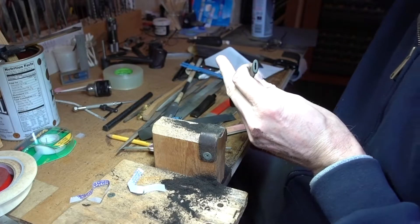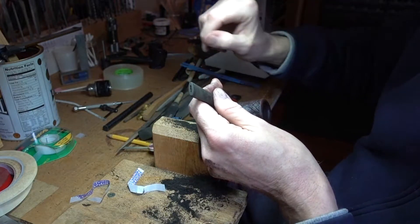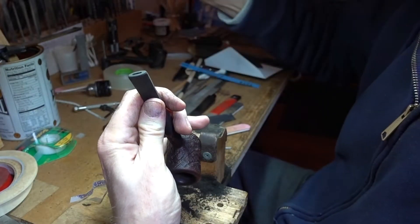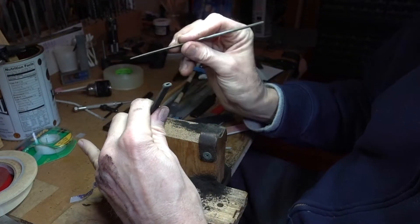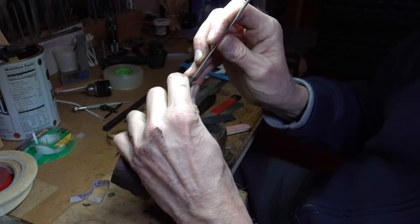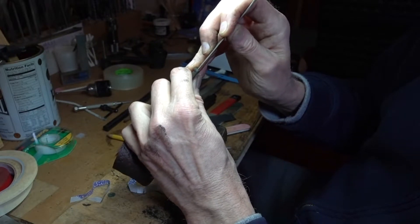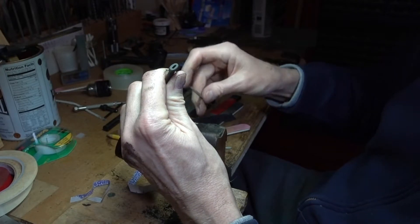The carving drill. And if you don't own one of those, or they scare you too much — because if you lose control, you can get an S-curve in your slot, and you're done — I would recommend using a thin needle file that's fairly coarse and just going after it like this. This will take you a while, but it's perfectly safe because you can't get ahead of yourself. It's tedious, but that's good in the sense that it's very difficult to make mistakes.